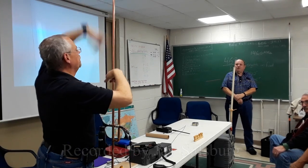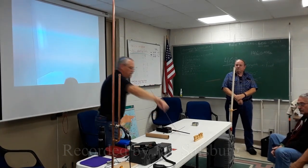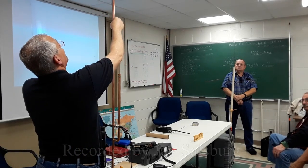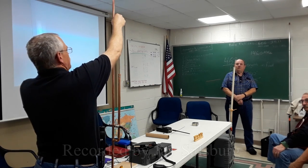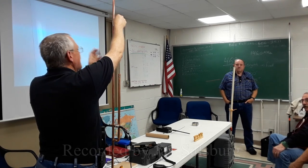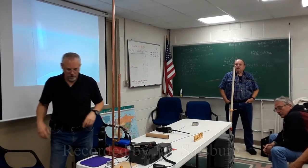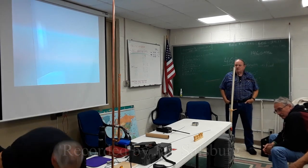You've got a half-wave dipole. That's essentially what this is. So this is cut to be a half-wave. It's a little long, but keep in mind, this is shorter for a reason. You remember? The diameter. Exactly. You guys are already on it. Okay, so that's a half-wave. This is quarter-wave. Everything's good, right? Let's get this hooked up to the antenna analyzer.